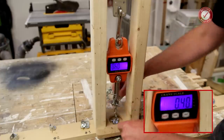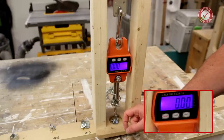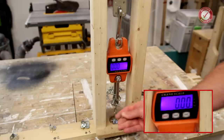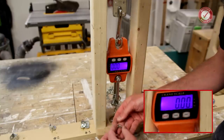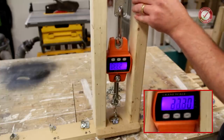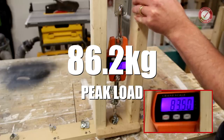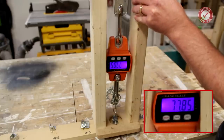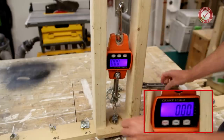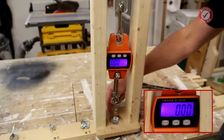So we're testing the unbranded screws that come supplied with euro hinges — the part that goes into the door normally. I think these are 4mm by 16mm. We'll test them and see how they do. They went past 80 again — not done bad. The main problem with these screws is the variable quality you can get in them, but this particular one seems to have been quite a good one.